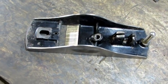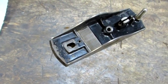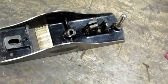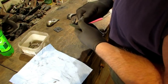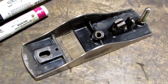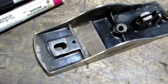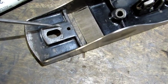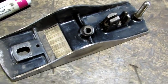With that looking really good, it's time to work on the japanning — about 90% is left, and there's some pretty good-looking japanning, but where it's missing there's quite a bit gone. I'm going to steel wool that area a little more aggressively to get rid of the surface rust, then use my paint marker to touch it up. The steel wool will dull the japanning, but the brightness will come back during the finishing steps. If your goal is perfect-looking japanning, you don't want to use paint markers — you'll have to strip it all the way down to bare metal and put a new finish on. The purpose of using paint markers is to prevent any more loss of japanning and make it look a little better, because wherever the japanning has come off there's a ridge, and applying paint over that ridge won't make it disappear unless you feather it in or strip it off.